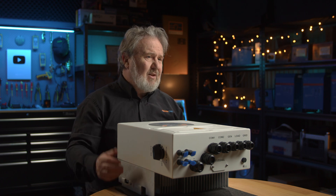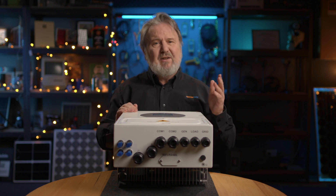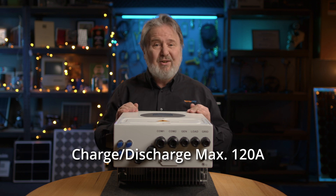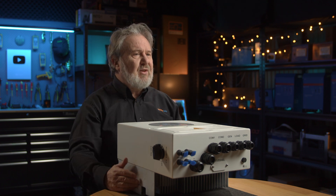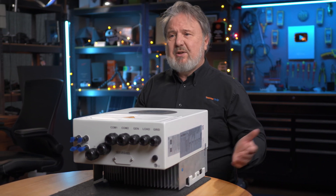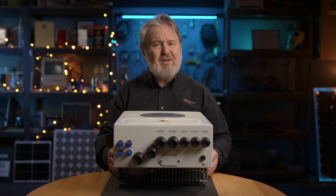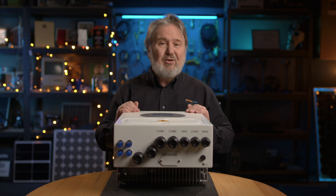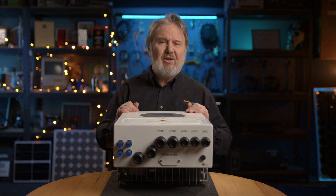What's interesting about this inverter is it can work with both lead acid and lithium ion batteries in the 40 to 60 volt range. It's got a big maximum charge current of 120 amps and discharge current of 120 amps — that's where it gets its five kilowatts of power from. It also does a three-stage charging profile with equalization, which is ideal for lead acid batteries. It comes with an external temperature sensor. And it also has charging strategies for lithium ion batteries — something in the manual called self-adaptation to BMS, so it can talk the right protocols with many battery systems. I'll put a list in the description of all the compatible lithium ion batteries.